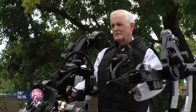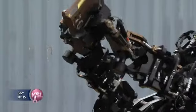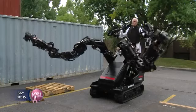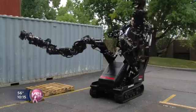They translate my movements with what is called force reflection. In the hands of the robot, now part of this modified rig, I have remarkable strength and agility depending on what's needed to fulfill the task at hand. Anything that the slave arm encounters in terms of force is also fed back to the operator, so he can actually feel what's happening in the workspace.